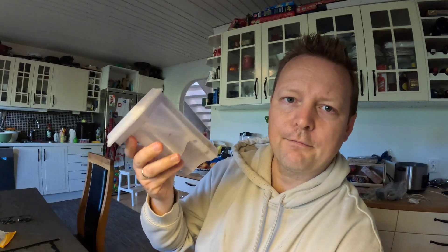I bought this model for a jet pump that is 3D printed — this is just a housing. The main issue I want to move away from is making a big hole in the boat. You don't want holes in boats, and I've seen people use these when building jet boards or jet boats. Since you cut a big hole both below for water intake and from the back to mount it, you get leaks — a lot of leaks. These are tricky to seal even with a ton of epoxy to get really tight so water doesn't come into the boat.